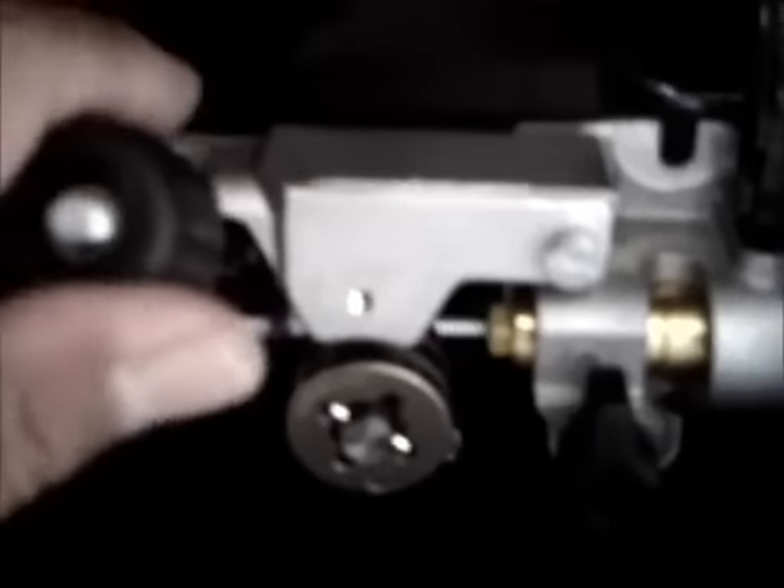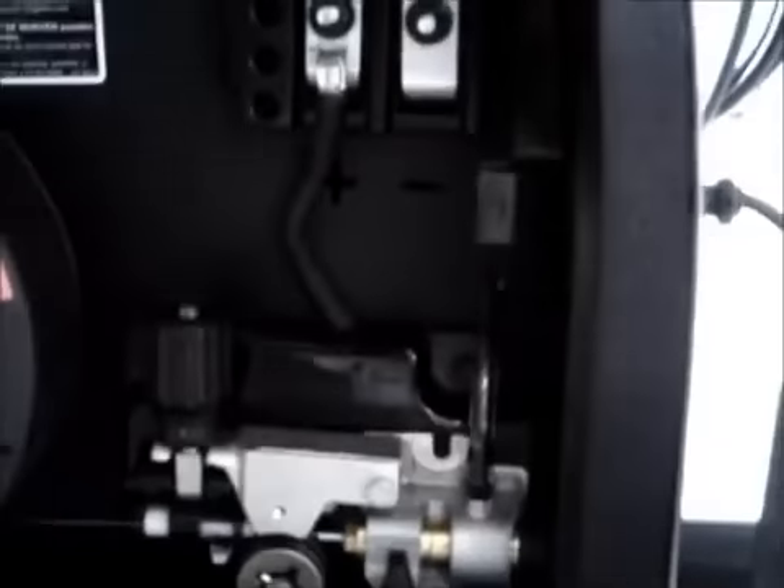Insert it like that — the wire is on the appropriate groove, we push our tensioner down. There's where your gas comes in, your shielding gas. If you're going to run a flux core wire, you're probably going to run a 0.030 flux core. You would adjust the polarity and just reverse these two leads — that's all you'd have to do to run 0.030 flux core.